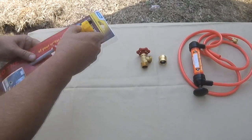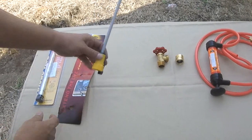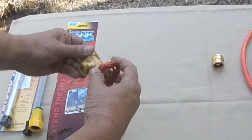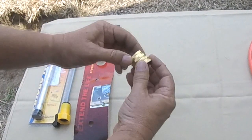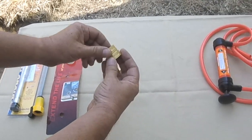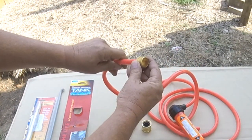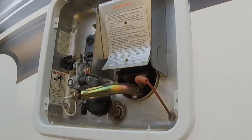I've been watching several videos on YouTube and most have a winterizing kit, but I do not. My intent is to get the tank drained, flushed, filled back up, and use eight gallons of water and two gallons of vinegar and let it sit for 12 hours. These are the fittings that I purchased and a small transfer pump so I can pump the vinegar into the hot water tank.